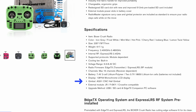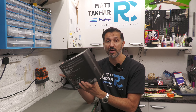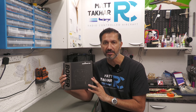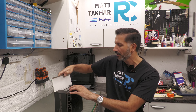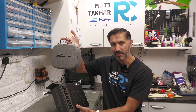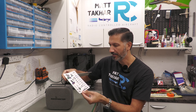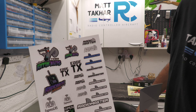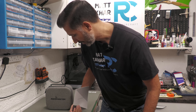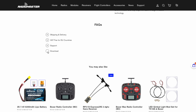You want your hardware manufacturer working with the software provider. There are lots of specs on the box. The weight is 532 grams, size 235 by 178 by 77 millimeters. Internal RF options include CC2500 multiple protocol, 4-in-1 multiple protocol, and ELRS 2.4 GHz — module dependent. Maximum 16 channels, receiver dependent. Battery is 7.4V 2-cell LiPo. The gimbal is a high-precision 4.0 Hall effect gimbal as standard. Software upgrades can be done via USB, SD card, or EdgeTX Companion PC software.